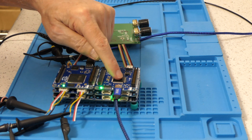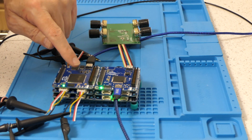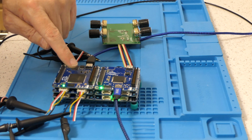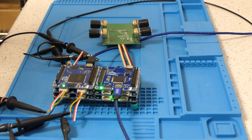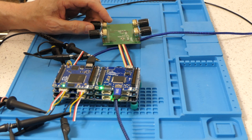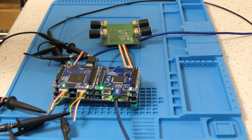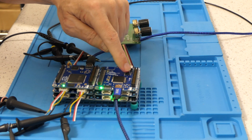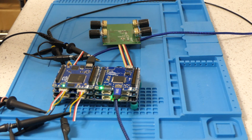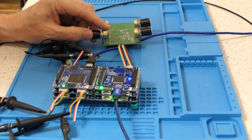So over here we have the 307, which is how I'll refer to the CH32V307 RISC-V, and this is the Trion T20. I'll refer to it as the T20. You know, I don't have to say all these numbers and letters all the time. So with my potentiometers here, I will vary the duty cycle and light up my 4 LEDs. There's a red, a green, a blue, and a yellow, and that's just to demonstrate some of the capabilities of the new RISC-V, which is really kind of a cool chip. Oh, by the way, I have some NOR flash here, SPI flash right here for maybe data logging, if I want to use it for that. So on channel 0 here, I have the red LED, and it should start coming up here. Yeah.